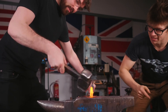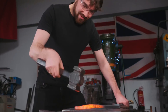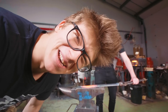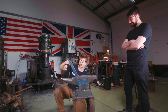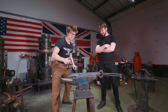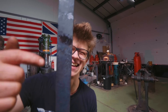He's killing it on the tip. Brush off the scale with your brush and work underneath the thing — real flex with it. So Brian, how are you finding it? My wrist is in bits because I'm a weak little man. He may be tired but he's doing a great job. So Brian has done a great job forging the point on the knife. We now need to work out how long we want the blade — we aim for about a 10-inch blade, allowing about a half inch in length to account for stretching as we continue forging. I'm gonna make a mark so we know where we're gonna start to forge the shoulder.